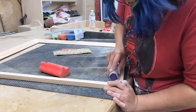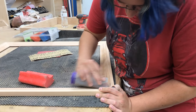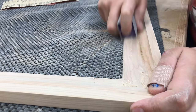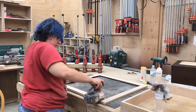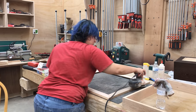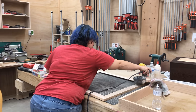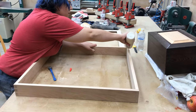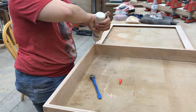After clamping we'll clean off the excess glue with a damp rag and let it dry. Then I like to sand the profile a little bit — some sanding before and some sanding after. These sanding pads and this sandpaper are really amazing stuff — I'll put a link to them in the description; they're very cheap and they really help you sand profiles perfectly. Once the picture frame has been sanded flat to get all the excess glue off, it's time to glue it onto the body of the shadow box.